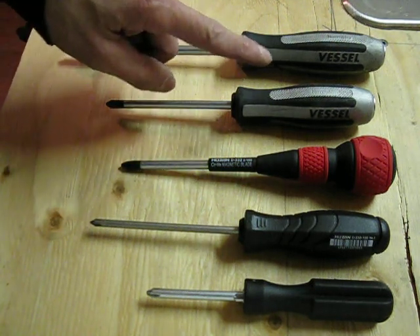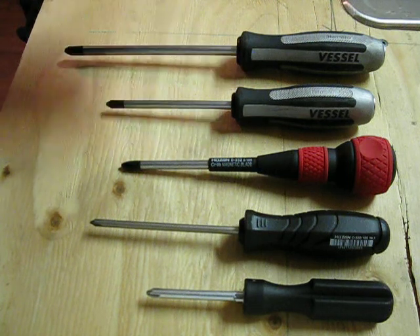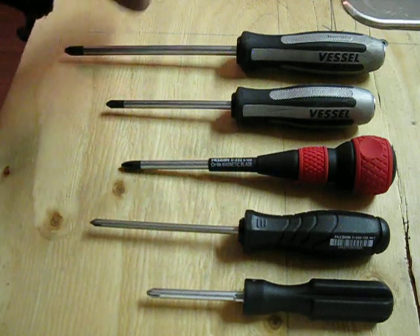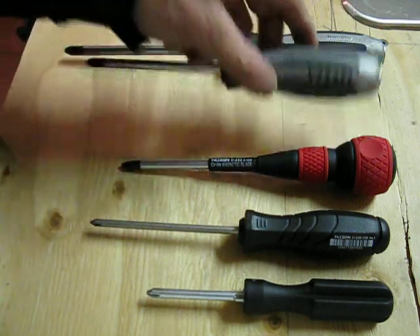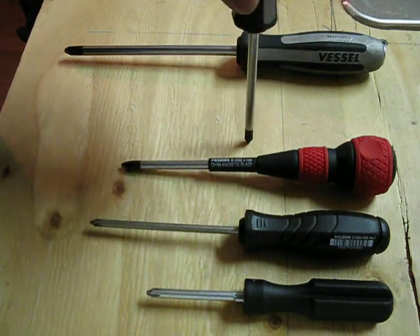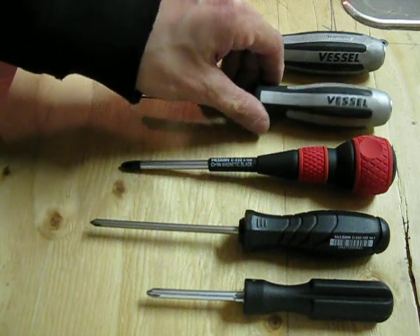The interesting thing is that you can use a Japanese screwdriver on Phillips screws, but if you try to use a Phillips screwdriver on a Japanese screw head, the Phillips will start to come out and will actually strip your Japanese screw head. But even though it looks kind of stripped and the Phillips won't engage anymore, surprisingly, you can still use a Japanese screwdriver in there and take it out without stripping it out — just because of that design of it staying in and not coming out.